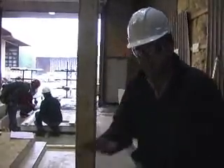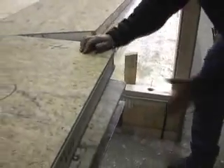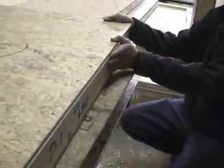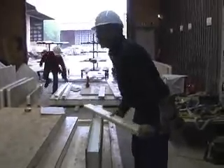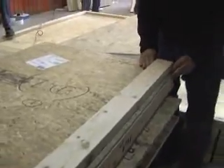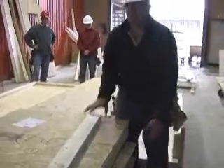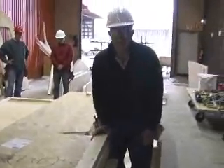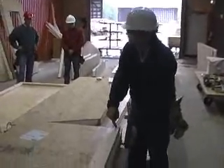We need to marry this panel up to this panel right here. Notice that this panel came as RTA, so this piece of lumber was already inserted. Instead of inserting this piece of lumber in this panel, we're going to insert it onto this panel. On the back, half an inch, up an inch and a half from the bottom, we're going to put our two beads of adhesive — because that's where air is most likely to come through in that corner. Then when we attach this panel, we're going to shoot 12 to 16 nails down into this piece of lumber.